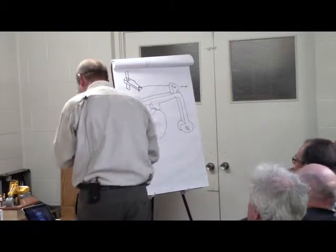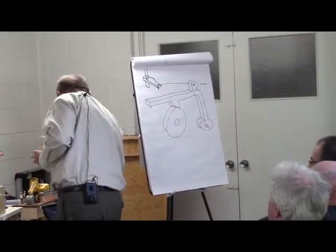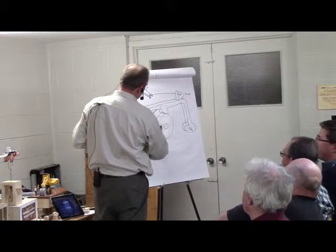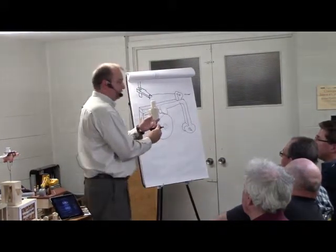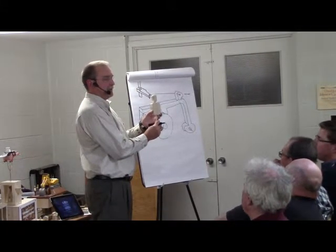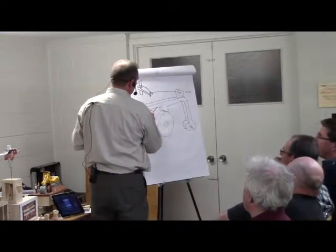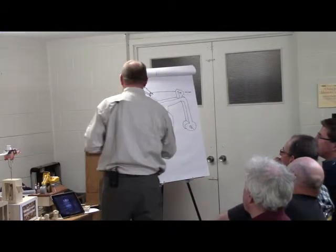And in fact, if you come up to the front and look at some of the work up here, you'll see that sometimes I cut natural weights in here, like this. I extend the follower, and this is actually only there for counterweight, so it actually pulls the head back the other direction. Okay? And in some cases, the pieces are so big and heavy that that's not enough. And I actually drill a hole in there, and I hang a little weight on it. And you can see that right here.